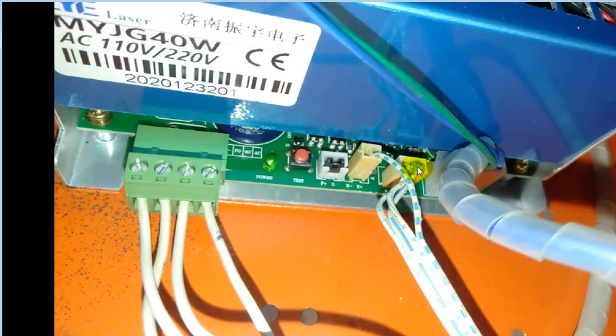Something I forgot — for the low signal trigger and the ground, this is from the PCB. This one is okay because nothing is different, you can connect directly. Also make sure the fiber connection, and compare with the old one. Make sure this is in the positive position. If you swap it, your test button will fire all the time. The new power supply is not 100% the same or 100% different — you have to make sure the wiring is correct.